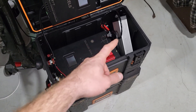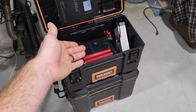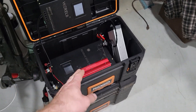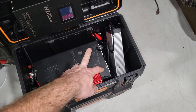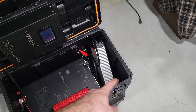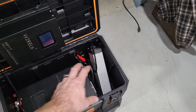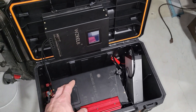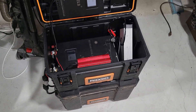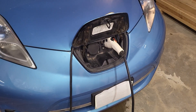I'm very happy to get five kilowatt-hours out of this pack on the AC side. On the DC side I haven't tested that yet, but it'll be about 10 percent higher. I was pulling the maximum of this inverter — it's split phase, so about 1,500 watts per leg. I was pulling 1,500 watts out of one side, but if I split the load to 750 per side it would be much more efficient, so I might get quite a bit over five kilowatt-hours with a properly split load.